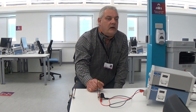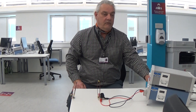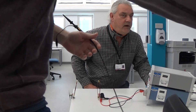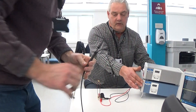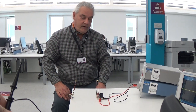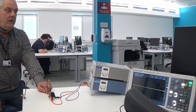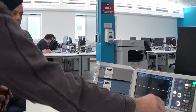Mike, you had a probe there — you were going to do a little experiment. You can measure its resonance frequency. Let's have a look at what frequency this is resonating at — let's get the oscilloscope in here. So we're on the transmit side. This is a centrally tapped coil, so we can go into the centre of two or three turns.